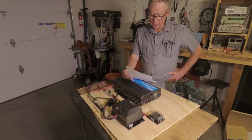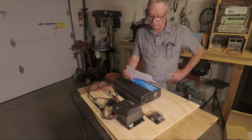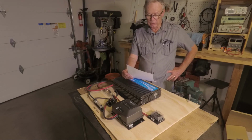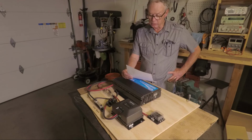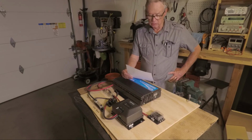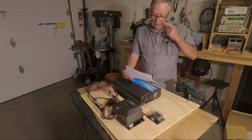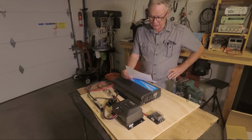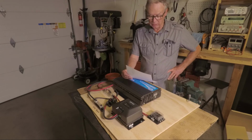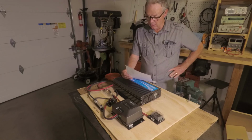I purchased the inverter off of Amazon, and there are many to choose from, so do a little research on the inverter that you need. In my case, I'm going to light the shed and backyard with LEDs, which is not really in need of an inverter, but I also want to run some power tools like a table saw, etc. Hence, I needed the inverter. Miscellaneous 4, 6, and some other gauge wire, some tools to work with that size wire and electrical crimp connectors, along with some fuse blocks for low voltage LEDs.